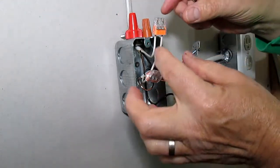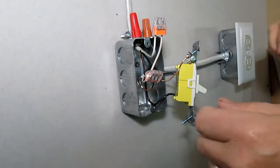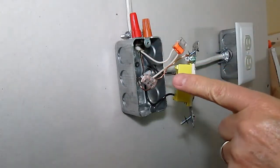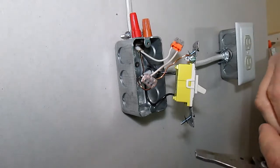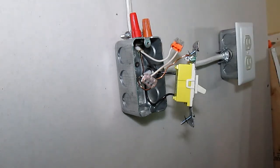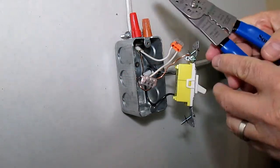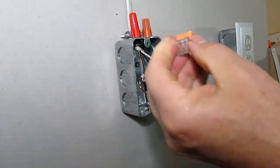What you do with the old-style wire nuts is as the wires come up, you take the wire nut and twist them together. I'm going to show you how to do that with the ground wires since they're already bare. The orange push-in type: this one connects three wires, this one connects four wires, and you can also get ones that connect two wires. You can still use a three-wire nut with only two wires — it'll work just fine.